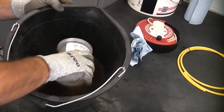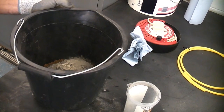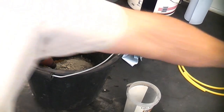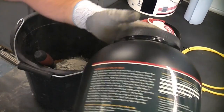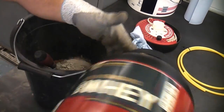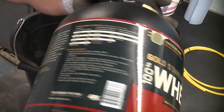So I'm going to put the cement on top of the sand. There are a couple of ways of mixing this up. I'm going to use this gauging trowel, but what you can also do is get a container like that — an old protein container — put the cement in there, give it a really good shake, roll it around the floor, whatever you've got to do, shake it again, and that will mix the two components together fully.